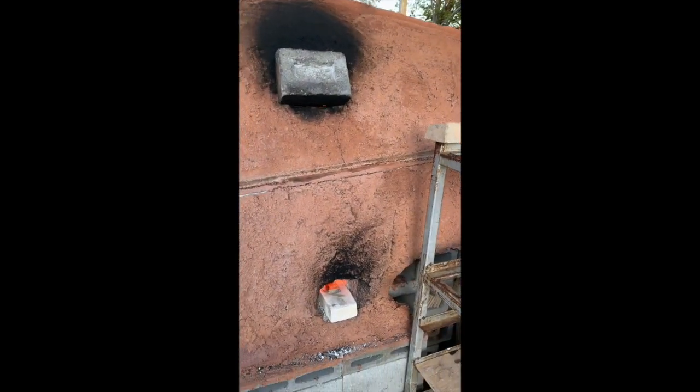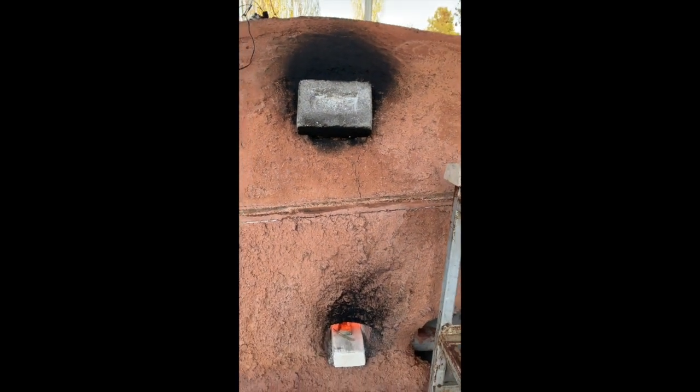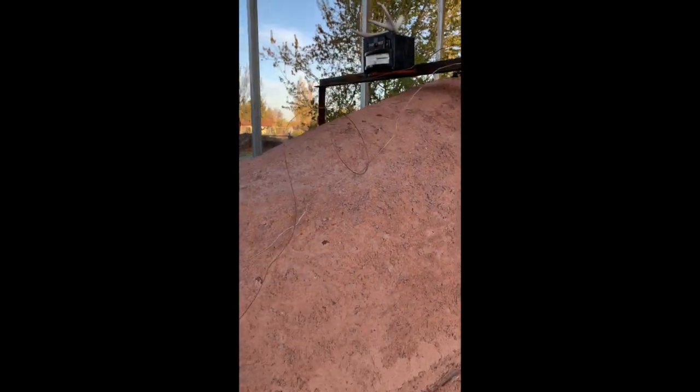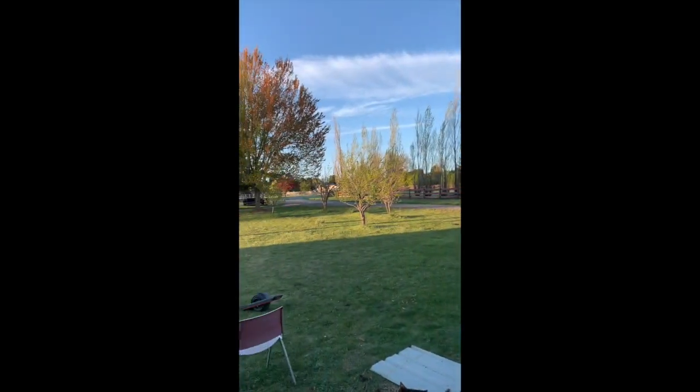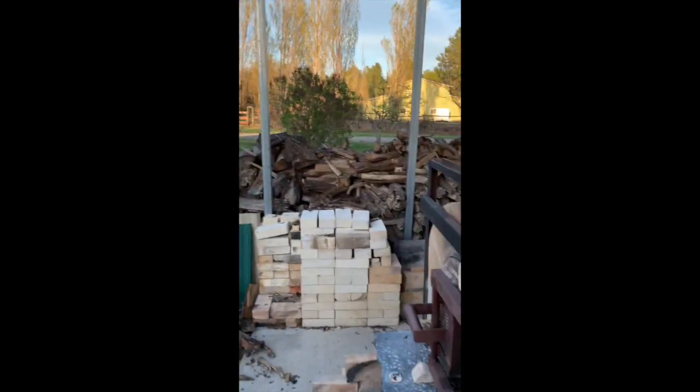So side stoke, the coal bed's been fairly high when I woke up and took over from Kathy. It was really high, so I'm burning that down. We did lose our cone pack up top here. The one down low, the 11, was flat this morning. It just must have whipped across the bottom, but as you can see, it's 22. It's tweaky there. I think the thermocouples are shot on those, but they're about 100 degrees behind. And there you have it. Beautiful day. Beautiful, beautiful day. Just a little too windy, but it's okay. A camper's keeping me in this nice little area.